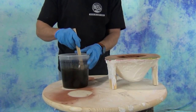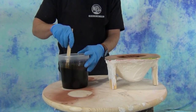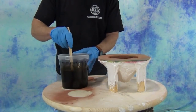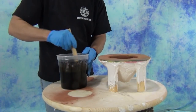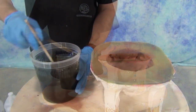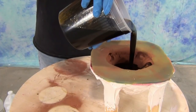That's important because if for any reason we've missed a little spot with our metal powder, or if we accidentally burnish through a little bit of the metal powder, we're going to see that brown color rather than a stark white plastic or even that bone-colored plastic. So it's really important to add some pigment here — just a small amount of polycolor is all it takes to push that over to a nice brown color.